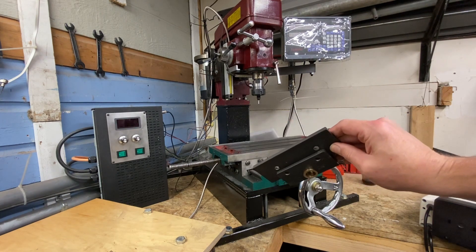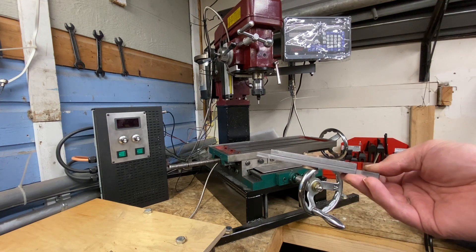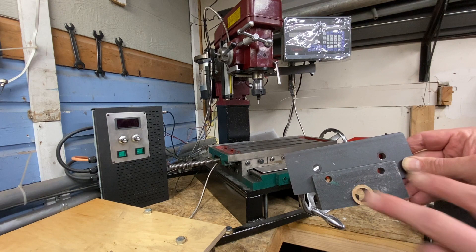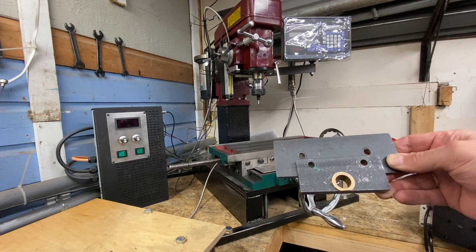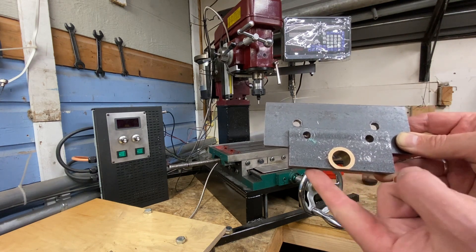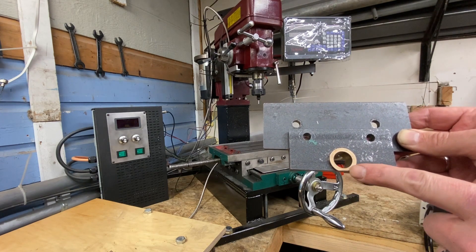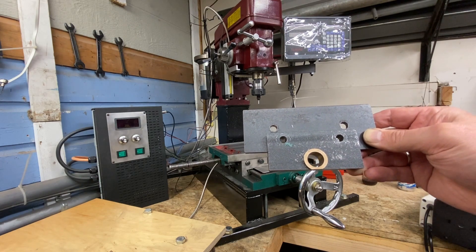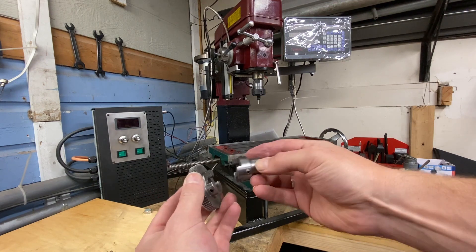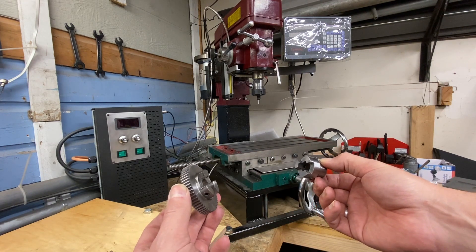It's just a simple steel bracket — quarter inch steel, two pieces at the bottom to give the bushing a little more material to rest in and to create the proper spacing. You have two holes which bolt to the cross slide table and two holes that mount to the power feed. I would have liked to go with a bearing instead of a bronze bushing, but there's not a lot of clearance — it almost rubs underneath the cross slide table, so there's only just over a sixteenth of material there, leaving no choice but to go with a bushing. This is the other piece I had to fabricate: I milled and turned down this piece to connect to the spur gear and allow better connection to the lead screw.